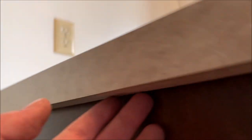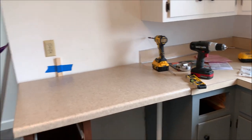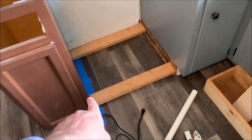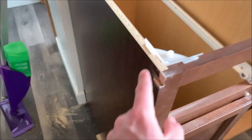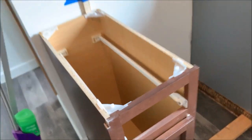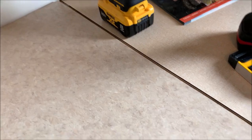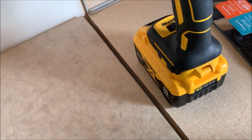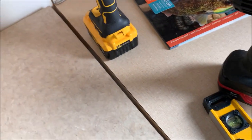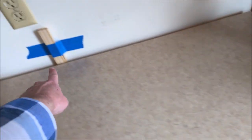My thought process is to cut this back by that much. To keep the front from sliding around I cut these exactly 24 and 1/8 inches apart — that'll hold it in place. I also notched this out using the oscillating saw to start, then got the last bit off with a chisel. So we're tight all the way across, but it gets wider on the back — I think this is because the cabinet wasn't square off the wall. Now we're square. It might be a tiny fraction off but I think this is affecting us a little bit.